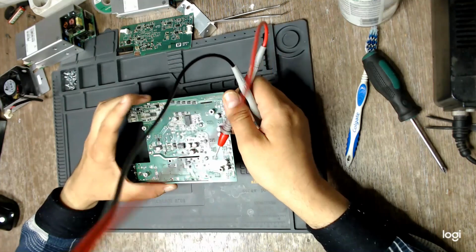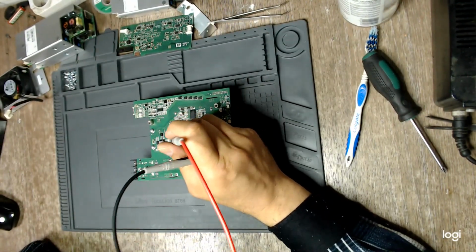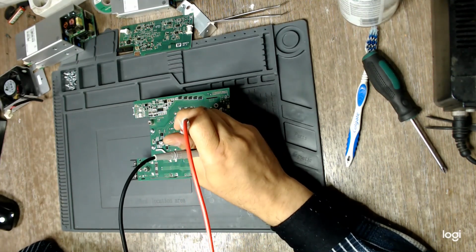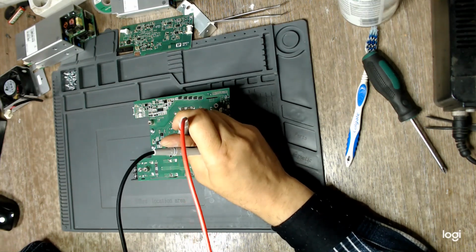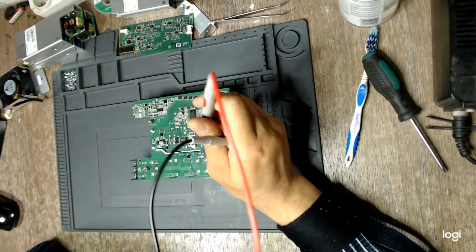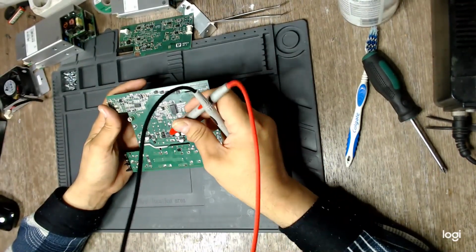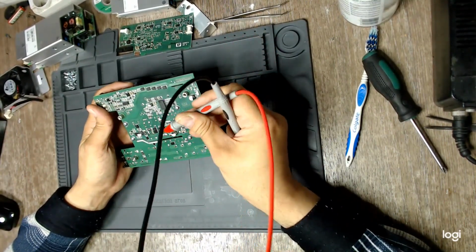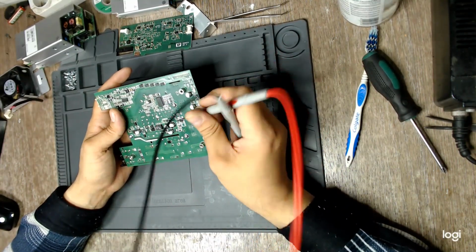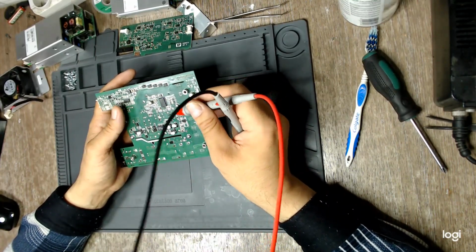What comes next? Well, I am thinking I put a new cap here in the snubbering network. I desoldered this flyback controller and I will measure its drain and source out of the circuit. And when I put a new driver in its place, I can test that I have a working flyback auxiliary supply. But before that, we need to make sure the MOSFETs from the PFC are safe.